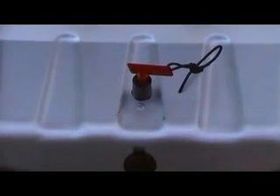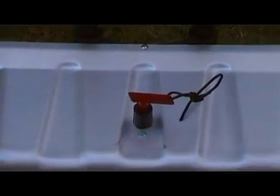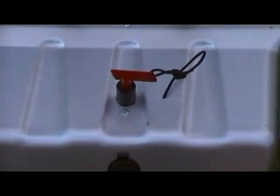There is a device on the back of the solar panel that regulates the charge and it won't exceed 15 volts. I'm also working on a wind turbine made from a vehicle 12 volt alternator, which is going to plug straight into the 12 volt cigarette lighter socket — solar panel during the day and the wind turbine overnight. That's my plan for hopefully having a 24 hour charge.